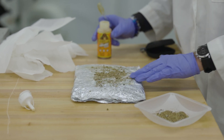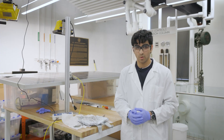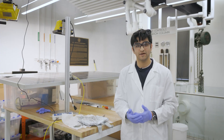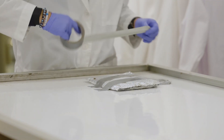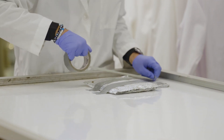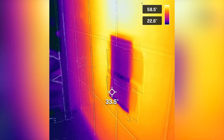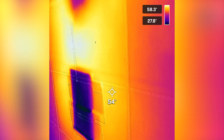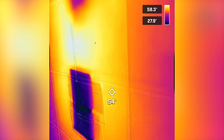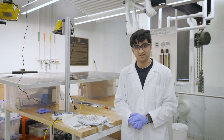Our patches reduce the operating temperature of the panel by about 5 degrees Celsius, which can lead to a gain in efficiency of 1.55 percent and an increase in lifetime of about 75 percent on a typical summer day in Ithaca. We hope to improve this technology further, create a global impact, and inspire other people to solve engineering problems like these MacGyver style.